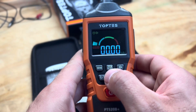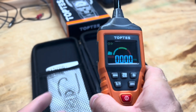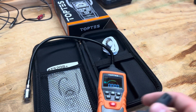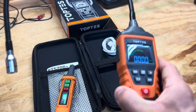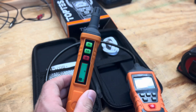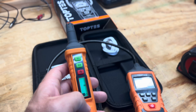Sensitivity is switchable between high and low with a click. You can mute it, and it has Celsius/Fahrenheit toggle. It measures percentage level of combustible gas and also gives you a parts per million readout — I don't think either of the other detectors did that. The General Tools doesn't give a parts per million reading, it just has a little gauge showing whether there's a leak or not. The PT 210 also does not have a parts per million readout — just a high/low sensitivity meter, though it is backlit.